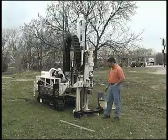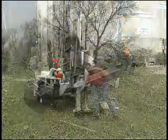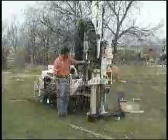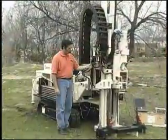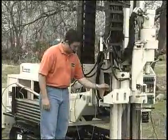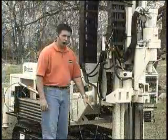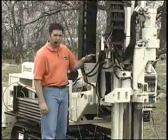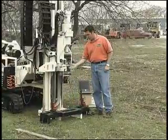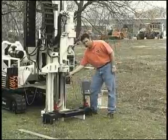What we've got set up today is a bridge with the anchors in place, where I could add extensions to the bridge or to the anchors to get more anchoring capacity. My string pot is mounted to a bracket on the GeoProbe here. I've got my cord going to my interface, and the string that comes out of the string pot attaches to the bottom of the foot, giving us a reference point at the ground surface. As the machine raises and lowers, the string will retract and extend. The microphone is just going to push up against the hex drive and is loosely mounted.